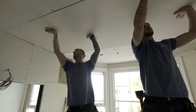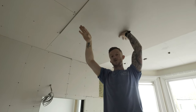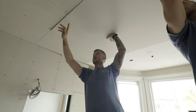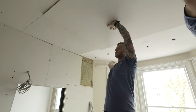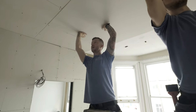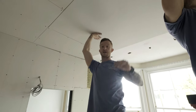It's also important to mention, before we fix this last one up, that the joints here are all staggered. As you're running across the joist, if there is ever any flex in the joist a crack may appear because there's movement and plaster is solid. It's important to stagger the joints because if you put them all in a big line, you'll get a crack that runs all the way across the ceiling. If you stagger the joints — for example, one here and the next on the next joist or as far apart as you can — it prevents any massive cracks going across your ceiling. You may just get a small hairline crack which you can fill or paint. It's very important that you stagger the joints at all times.